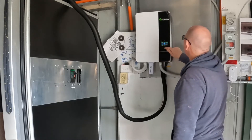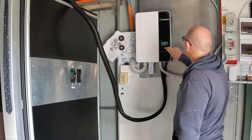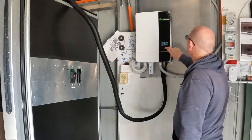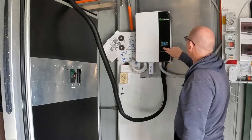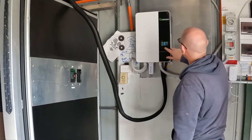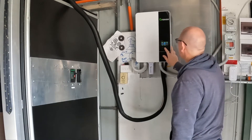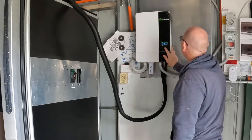I've put out 6.6 kilowatt hours from the solar array on the roof so far, and it's only putting out 0.2 to 0.3 of an amp off the solar array — so at 334, we're probably looking at around 65 watts, which isn't much. But it's winter here, we've got overcast cloud everywhere and it's pretty cold, so I'm pretty impressed with that.